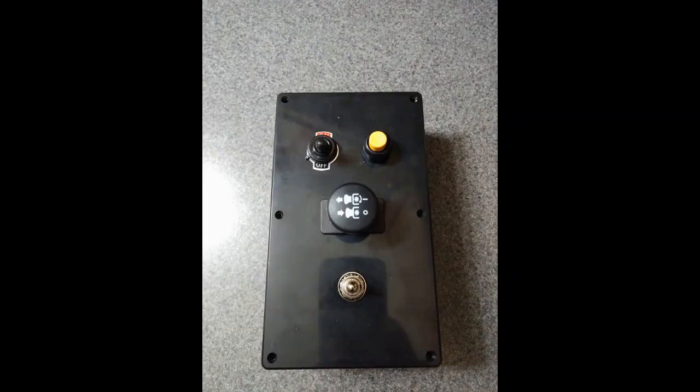Here's a picture of the remote control that I've built. The upper left-hand corner is the engine kill on and off. Upper right-hand corner is the start button. Right in the center — you pull that out, that starts the augers via the PTO clutch. The very bottom is left and right for the chutes, to move them left and right.